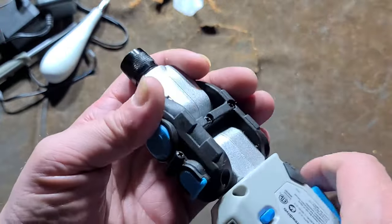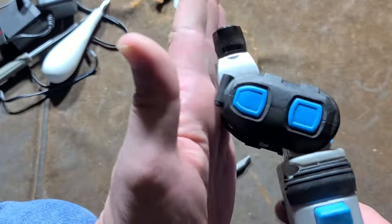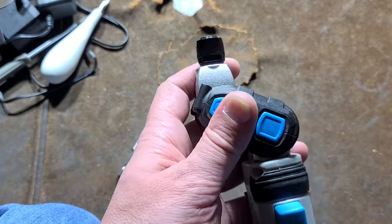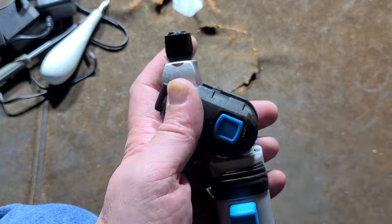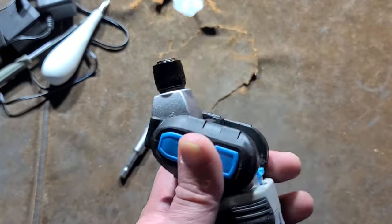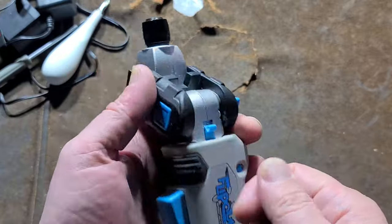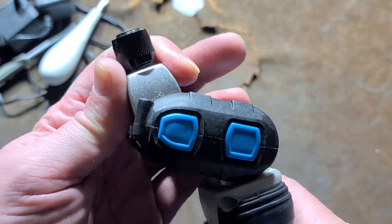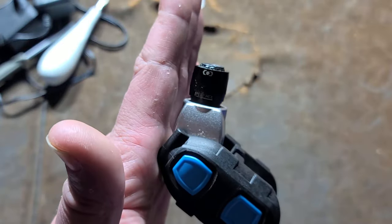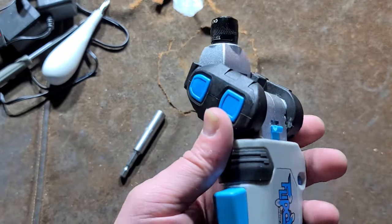The biggest advantage of something like this, even though it's gimmicky, is for people who really need to get pretty flush against the surface. Many times installing or assembling sheet metal shelves and that type of stuff often have screws that are really close to surfaces. Versus using a drill or impact driver with one of those little right-angle adapters — those are about your best bet — but then you have to manage the little right-angle bit, where this still locks in place and will allow you to start some screws real flush against the surface. You probably need three-quarters of an inch or something of side clearance.